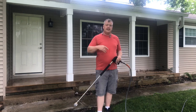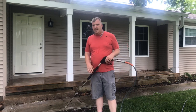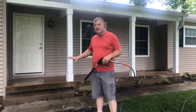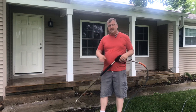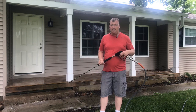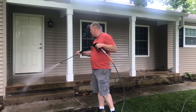What you can do is take a mixture of something like Clorox bleach and put it in a pump-up sprayer or in your pressure washer. If you're going to use a pump-up sprayer, put about a half gallon to three or four gallons. Just set it on there — you don't want it to dry. I have a mixture here; it's ten to one, about one percent sodium hypochlorite.